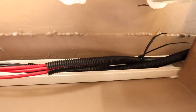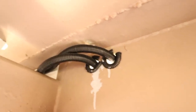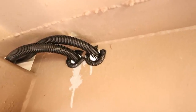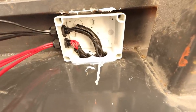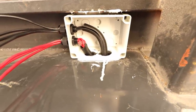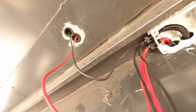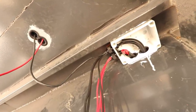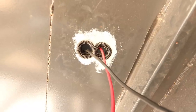Right up under here we've got more conduit where it goes out of the clip-on white conduit and into black flexi. It goes through our ready-made holes in the side, with conduit going through the holes so that there's nothing that can touch anything. On the outside of the boat they come through — I probably need to trim that conduit a little bit more — but they come through and go into this waterproof box. That gets a lid put on top and that's what seals everything water and moisture from going into the boat. From there they go through cable glands. We'll tidy it up, move it closer to the roof, and put black flexi conduit on that leading through those two rims with the old flexi conduit trick.